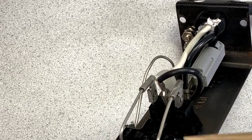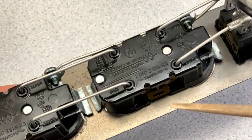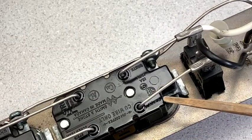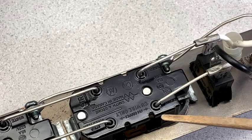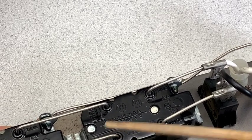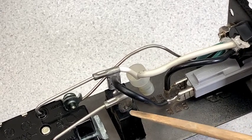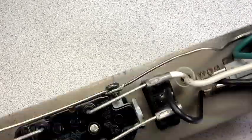One of these days I might upgrade the wiring to insulated wire, except I might also have to replace the sockets because they've used quick-connect push-in style sockets and I can't find any kind of release for them. That presents a challenge getting the wires out. While I wouldn't mind destroying these wires, I don't fancy having to replace the wires that connect to the switch. So the first thing we have to do is disconnect these wires.